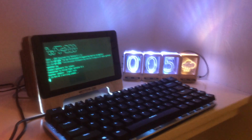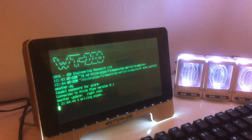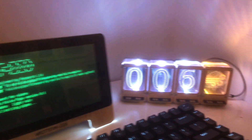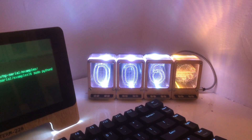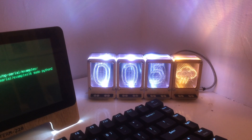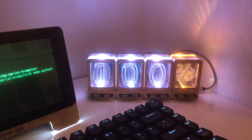The first thing it does is auto-detect the Nixie Pipe on the FTDI USB serial — you can see it's connected to Nixie Pipe version 0.1. It gets the weather — light rain — and then writes that to the pipe. It basically changes every five seconds: six miles an hour of wind, five degrees with rain cloud, and then 100% humidity.